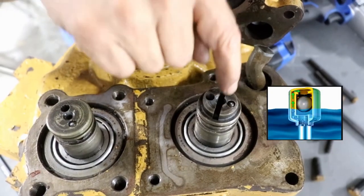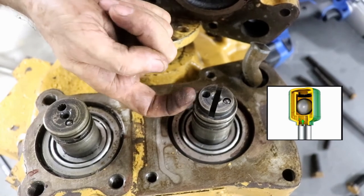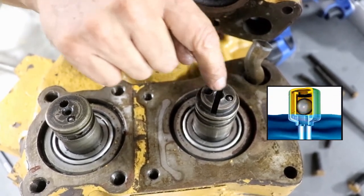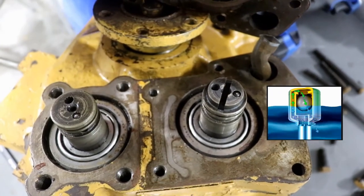Compress the ball and enter. And in the opposite direction, if the pressure of the fluid is bigger, it compresses the spring and the fluid passes over there. These are two check valves in order to allow the flow of the fluid in one direction entering and returning in the other direction.